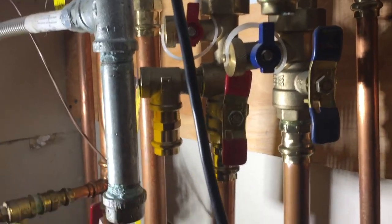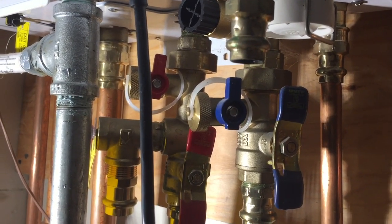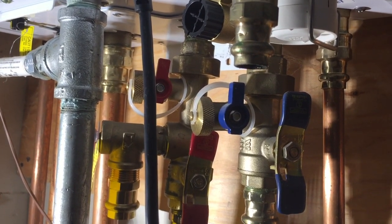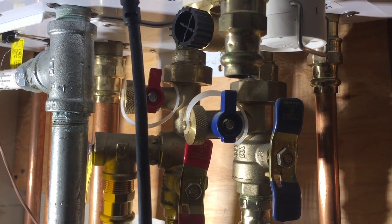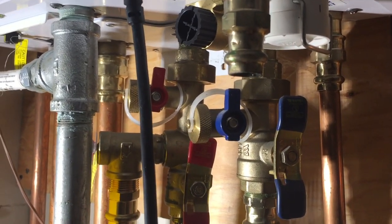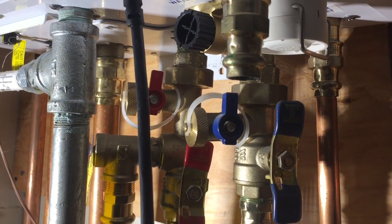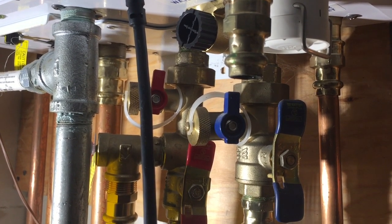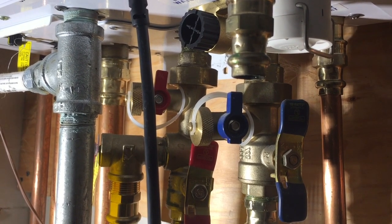All right, you see what we got here. This is no bueno. And a lesson learned here, folks. So that's what I'm thinking happened. I'm thinking perhaps that this condensate line was clogged. Okay? Well, you would know more than me. I'm sure. Yeah, it's the first time I'm actually seeing this. In these units? Actually, I'll be honest with you, I used copper for a condensate line. And maybe I'm going to go back to my manual and look, make sure. I've been using PVC as of lately. Right. So we're going to change to PVC. Condensate's producing some acid, huh?